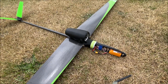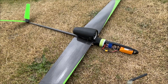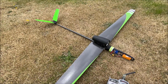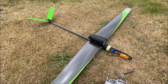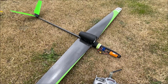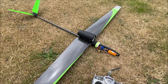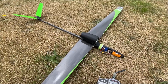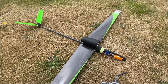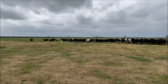With the battery connected you'll see my pitch control and roll control — that gives plenty of authority. I've put quite a bit of pitch in there; mostly it'll seem like way too much pitch, but it's actually quite doughy. That's probably a combination of changing the angle of incidence of the main wing versus the elevator pitching it around, and probably the nose-heavy CG. So we'll go fly it — and today we've even got an audience watching!